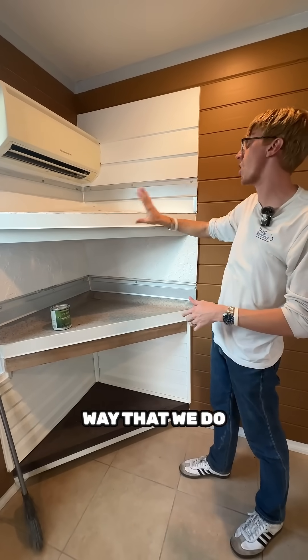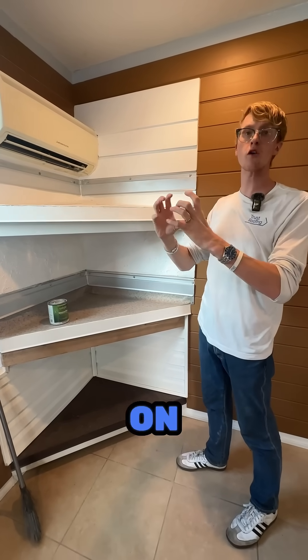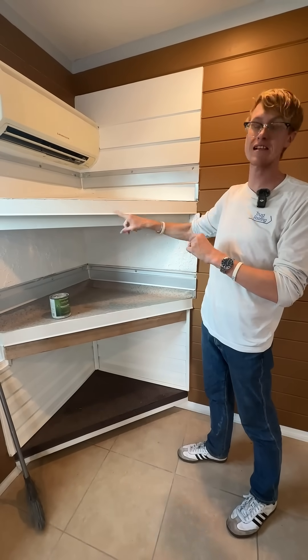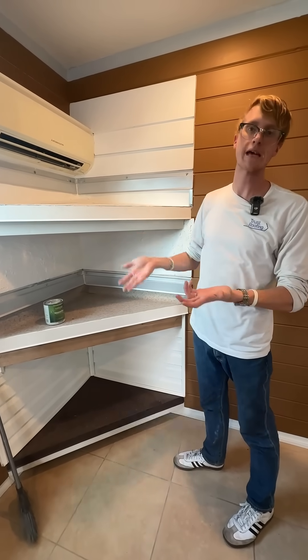That's the way we do all of our drip edge details. To give one example: scuppers on a roof — a drain where all the water goes — are always made out of clad metal. The reason is that the weld is a lot stronger than a tape product.